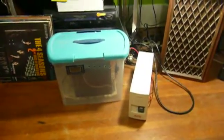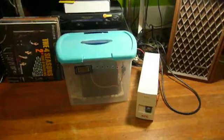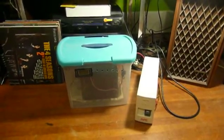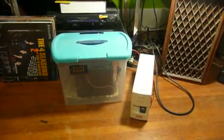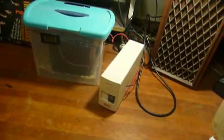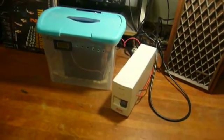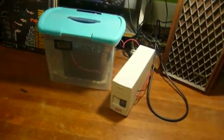What's in there is a NAPA lawn tractor battery. While a better battery for this would be something like a deep cycle rated gel cell, the NAPA lawn tractor battery has the advantage of being cheap, and if we don't discharge it too deeply, it won't have any trouble supporting the load and lasting a long time. In fact, this one's already about a year old. The way this basically works is I've opened up the UPS, located its battery leads — two female connectors — drilled two holes in the side, and ran heavy gauge wire into a set of male connectors. They're all insulated, crimped down nice and tight, covered with tape, and then I shut the bottom of that thing and never needed to open it again.